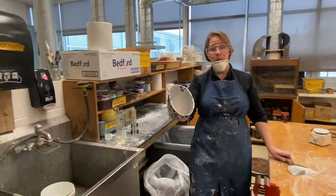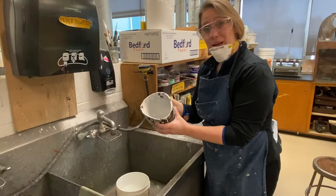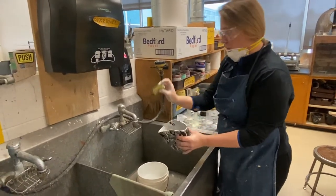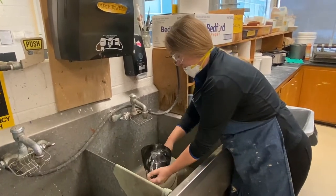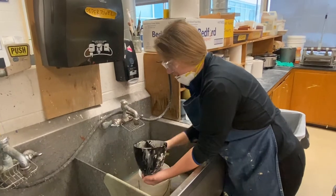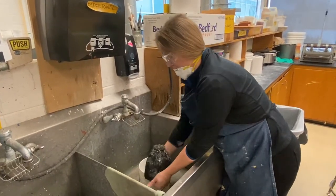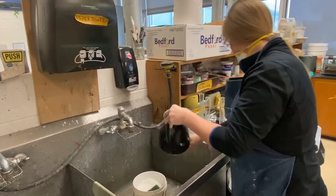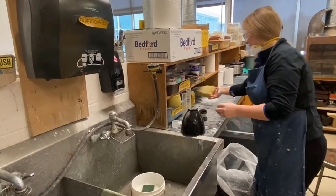I need to wash the rubber bowl inside a bucket, because this investment cannot go down the sink — just like it's permanent in clothes or jewelry, it's the same with pipes. I take a sponge, add a little water inside the bowl, and wash it out. Once the bowl is clean, I set it here to dry. I don't need to worry about cleaning the counter right now.